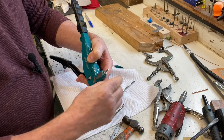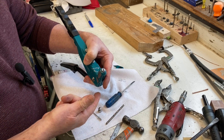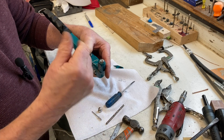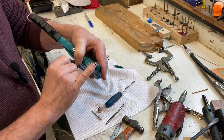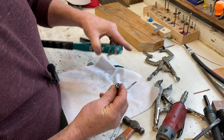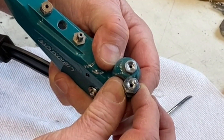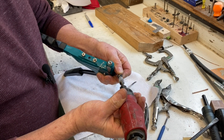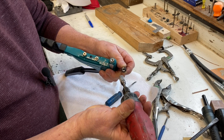Another option, once you get these ground down flat, is to put them in the mail and send them to Zenith — they'll machine the dome in and send them back, and you'll be up and running. If you're worried about the radius, I'm not — these look exactly like the ones they did for me. Here's an A5 that they did and they're exact. The radius is perfectly round, not flat or ovaled out.